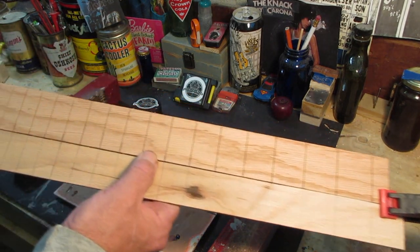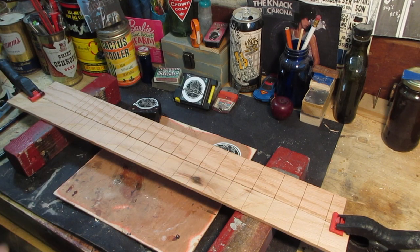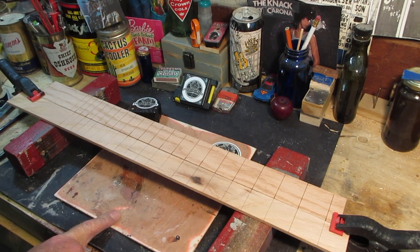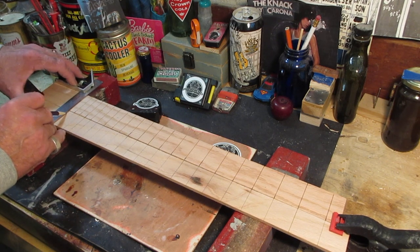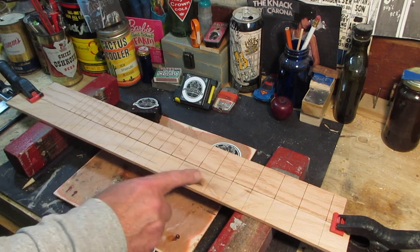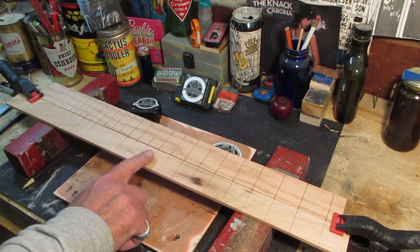We've got them marked all the way down. Please don't use something like a Sharpie to mark - you want these to be dark enough to see and you don't want anything bleeding in. Also before you start marking everything out, make sure there are no cracks or blemishes. It's easy to get sloppy and speed up here, but this is a place where you don't want to screw up - if these aren't right, your intonation is going to be wrong, and artists that actually can play aren't going to like this.